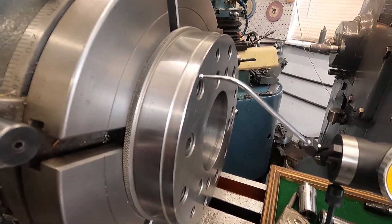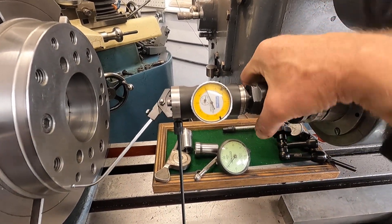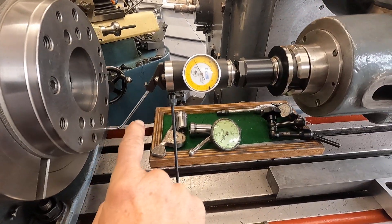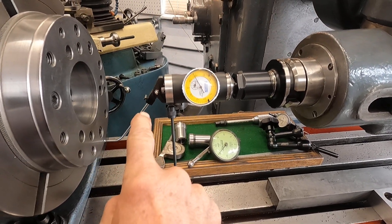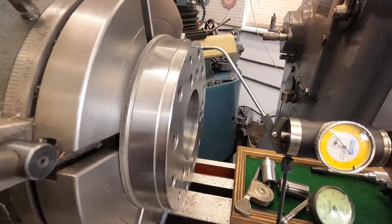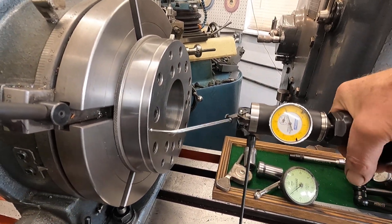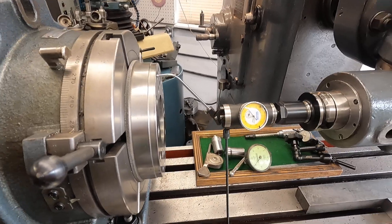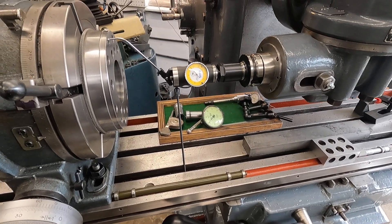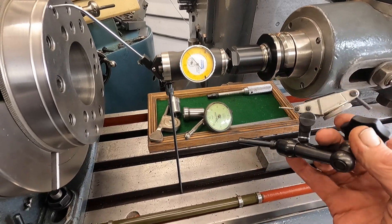I got contact on the face and you can actually tell on the dial that it's out of tram. I'm going to play with the angle - I think the angle is wrong so it's not reading correctly. But you can tell something's out of tram on the face with this gizmo. It's interesting. I'm glad I have it. It'll be handy on this machine because it's kind of hard to do things on this machine compared to lighter weight ones.